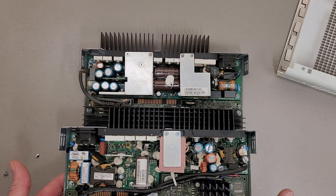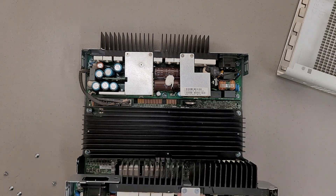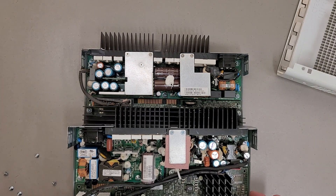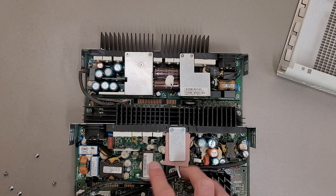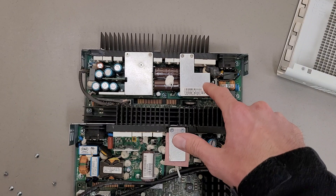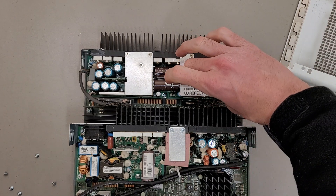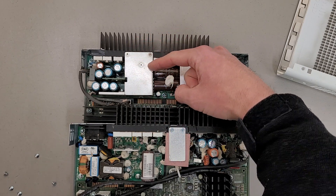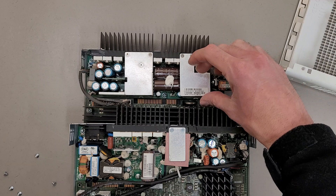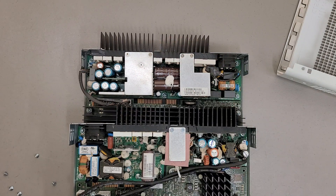Since I have the 3560CG handy, I can do a side-by-side comparison of the power supplies. It looks like there might be a couple more power transistors, or maybe it's just a different layout. The CX has bigger transformers — the 3560CG has one small transformer and two little ones off to the side, versus the 3560CX which has two big ones. It also has bigger filter caps: 150uF versus a single 120uF on the CG, plus more filter caps on the side.